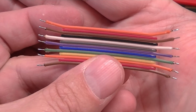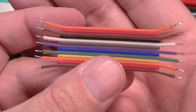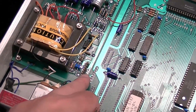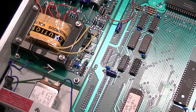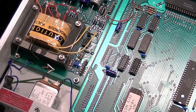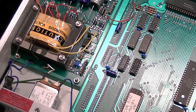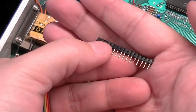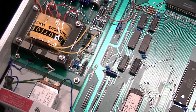We are all soldered up and looking good. We need a detachable end for the connector on the power supply — you can get solder-lug pins that fit here, but they're fairly expensive and no one really stocks them, so you'd probably have to buy around 2,000 at a shot. Instead we're going to use normal SIP-style socket and stuff our wires in there and solder it — that'll fit this plug just fine.